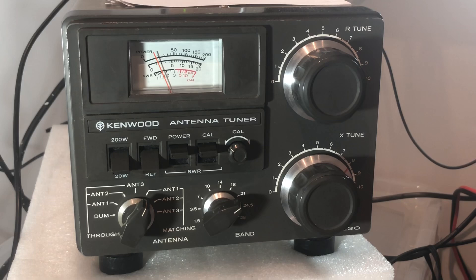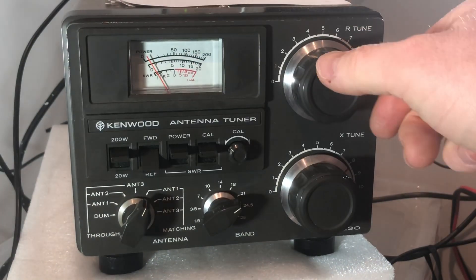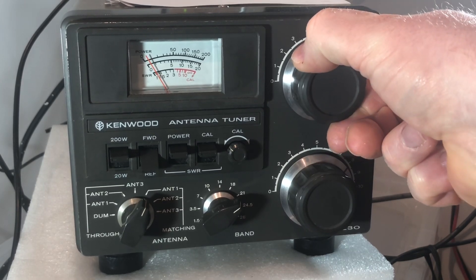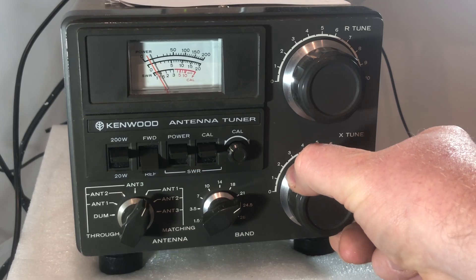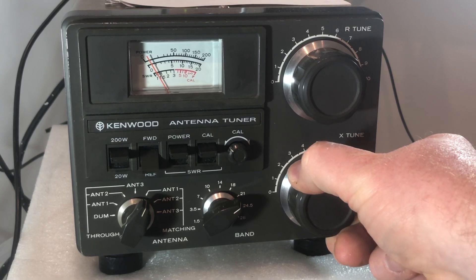100 watts out on FM and I see very little reflected power. I'm going to try and just notch this back a bit. If we put this on to 200 watts, you can see there's very little reflected power. Apologies for the fan noise from the PSU kicking in. Let's try and fine-tune this and bring it back down even further. I'm not sure we can get that any better. Checking the SWR reading on the radio — I think that's about as good as it's going to get.